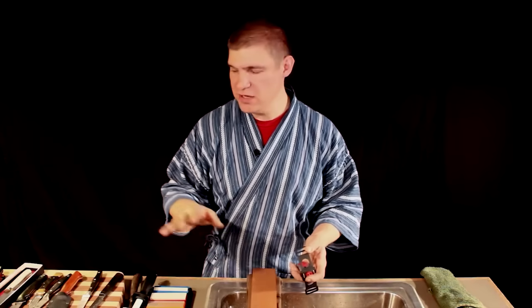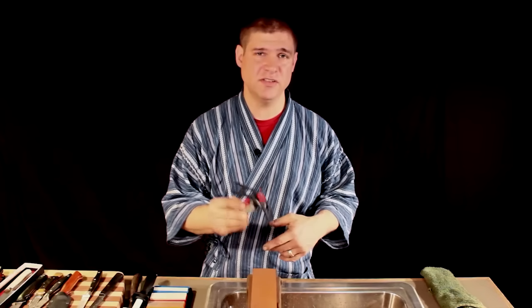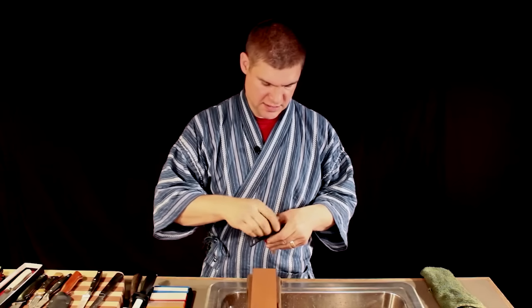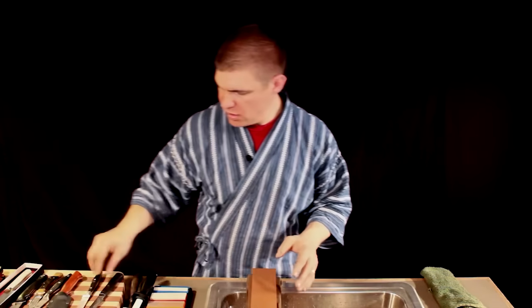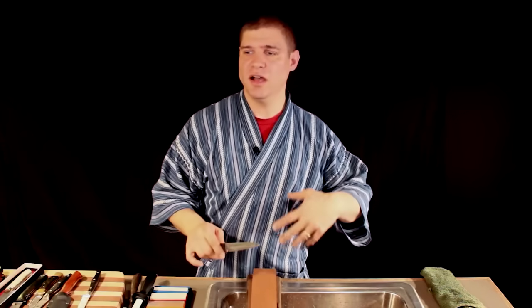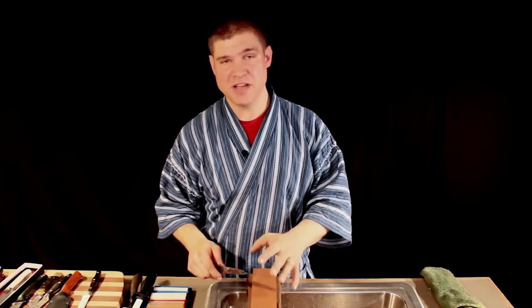And you can do it, because everyone who's been watching my videos up till now has had great results. So you can too. Take your jigs and devices, throw them up on eBay and get rid of them. Get some money, get yourself a good set of stones. I'm not just trying to be a wise guy here. That's really my advice. You need to learn how to do this freehand so that you can master these techniques. Angles, when you sharpen the same knife on the same stone 5 or 6 times, and then you actually use that blade in the field, in the kitchen, wherever you use knives at your place of work, you will learn intuitively how much you need to raise the back of that blade off that stone to create a new primary edge for your cutting task.